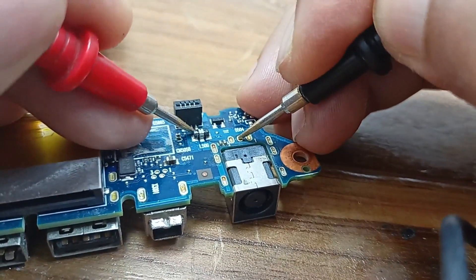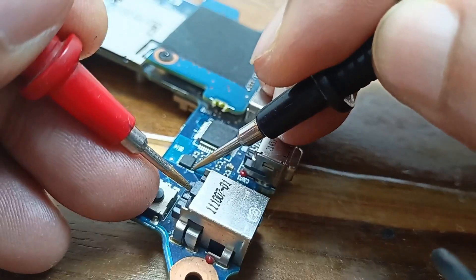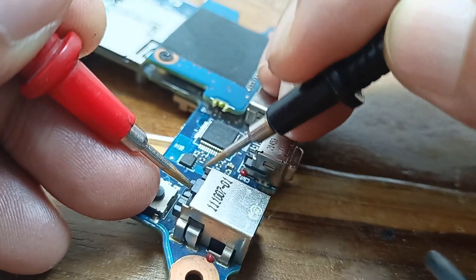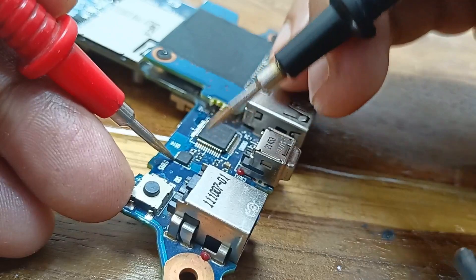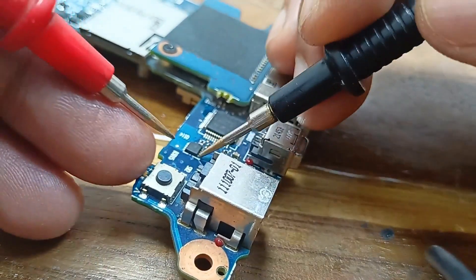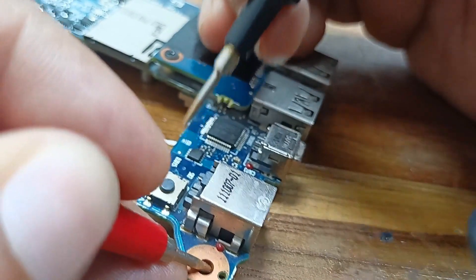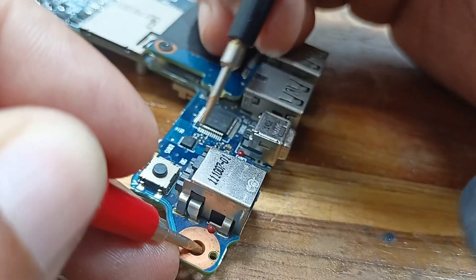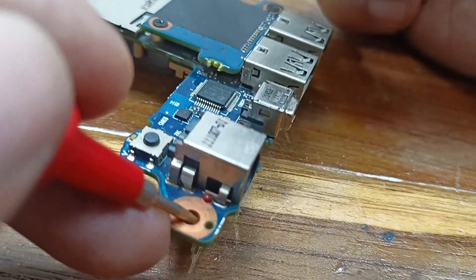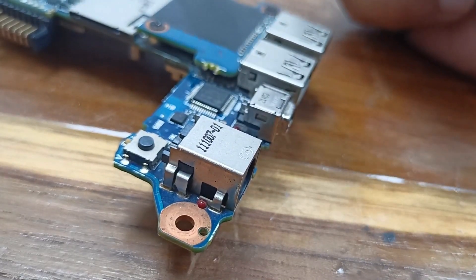From here it's going to the fuse and after that, this is the input voltage. This MOSFET and this MOSFET — the charge voltage goes through this MOSFET and spreads all over the circuit. Let's see if this MOSFET is working or not, and check the output area for a short circuit. Here there is a short circuit sometimes, and when that happens it cannot pass the voltage and this MOSFET stops working.